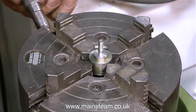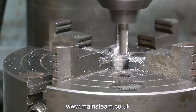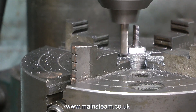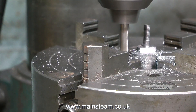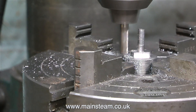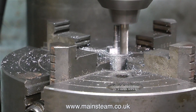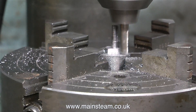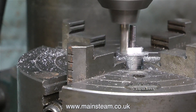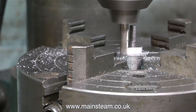The next part of the operation requires the milling machine. This is the four-jaw chuck that lives on the rotary table, and what I'm currently doing is milling some flats down the center section of the part. One of the rules of milling of course is always make sure that the direction of rotation goes towards the part you're cutting - that way the sharp edges on the milling cutter can do their stuff. I need to reduce the width of this part of the component to accurately fit in the anchor link, the cast iron part that it's going to be working in. So as I get closer to the finished dimension, I'm being very careful, brushing the swarf away so I can clearly see how much I'm removing and trying the part in place.